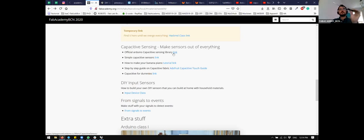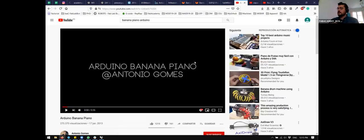Touching here is not the same as touching there, because there is more resistance in the metal between different zones and the microcontroller. We can measure this resistance and how sensitive the circuit is. That's also the part that Oscar will cover — how to clean these noisy signals. Capacitive sensing is something we use every day: when you touch your TV to switch it on without a button, that's a capacitive sensor. Most electric cooking plates at home use capacitive sensing. And your smartphone is essentially thousands of capacitive sensors arranged in an array.